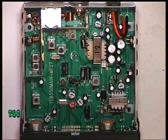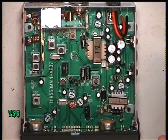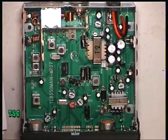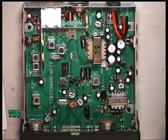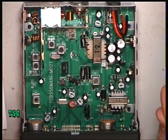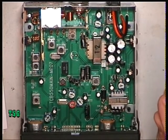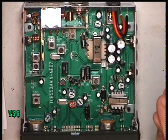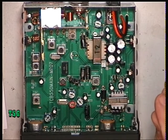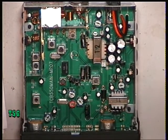Welcome back to the receive section of the TTI TCB550 early version. The service manual says we start with inductor LR1. I've got my signal generator set to 27.79125 MHz, UK channel 20. At the moment you're hearing a 3 microvolt signal going into a SINAD meter, and the output of that is onto an oscilloscope.